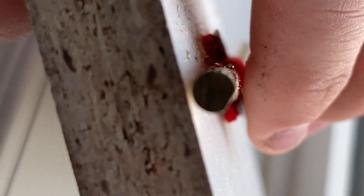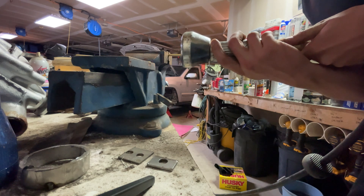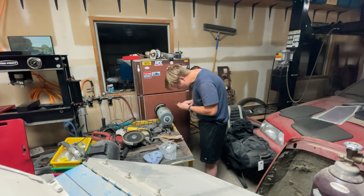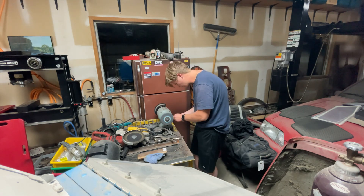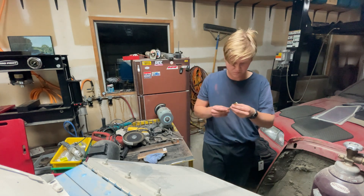At first I thought it was going pretty well with that initial line, but the shaft moved and the bit dug in. So I decided that machining wasn't a good idea and moved on to hand-making them. I cut it off with a little baby angle grinder, as you can see here, and then went over to the bench grinder to make these two shafts. The sad part is I never ended up even using these in the current design, because I added another support bearing, so I had to make more the other day using hand tools.